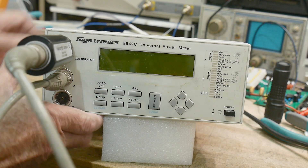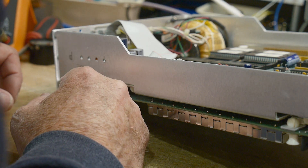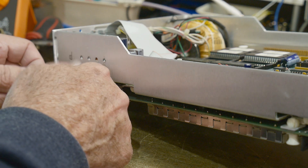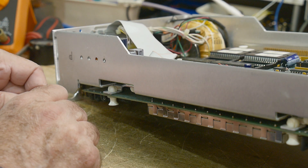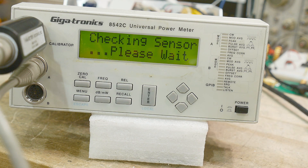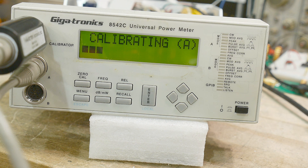I need to get that sorted out. Forgot all about that — that's these four little holes here. Those little guys are getting super hot in there. We need to put in some screws and that should be fine. Now we have a heat sink. Hopefully this will make it happier. Now it's calibrating good. Good to have your power supply stable.